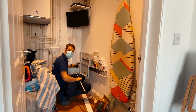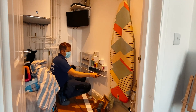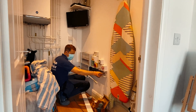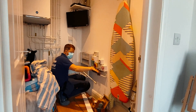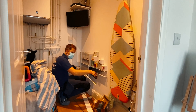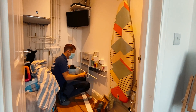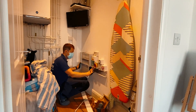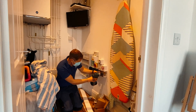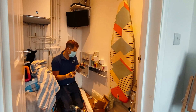I've just been measuring up. Where the tails come through in the back of the meter box is here, and if I measure about a meter from there it takes me to just the other side of the gas meter box — which is where I want to go. I'm going to drill a hole here, drill down at an angle, and come out in the brick on the other side just to one side of the gas meter box, a little bit lower. I'll put a whisker box on for the cable, clip the cable down and along the wall. Then I'll drill through the PVC, through the plasterboard, and use my long pilot drill bit to go through the brick at an angle without a hammer to avoid popping the brick out on the other side.